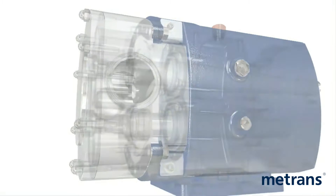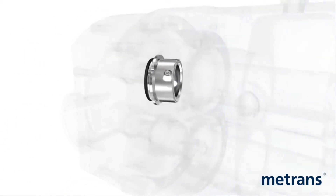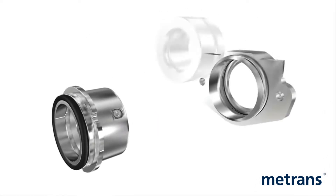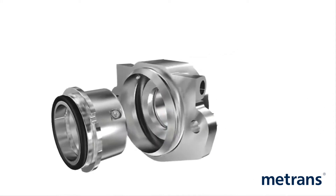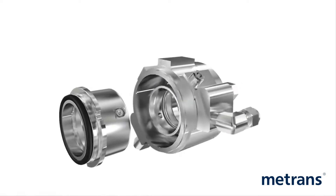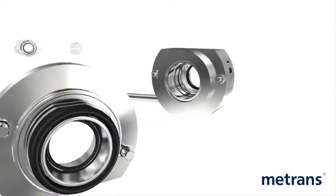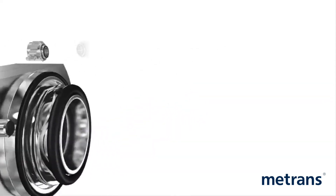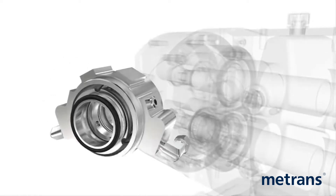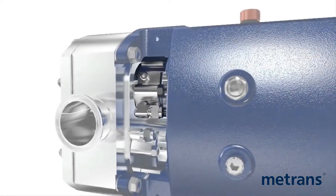The SRU provides many seal solutions, which makes it suitable for a wide range of applications. The SRU offers the choice of single, single flush, and double mechanical seals, all of which are easily interchangeable. Seals are also available in R90 and HiClean versions, as well as other proprietary seal designs. In short, the SRU has the right seal for the job, resulting in long seal life and reduced maintenance.